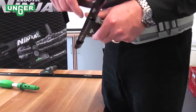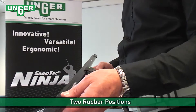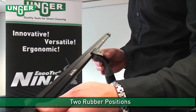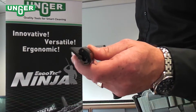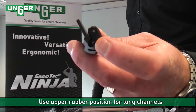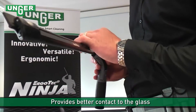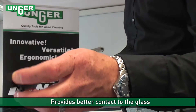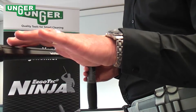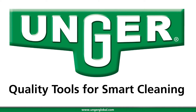The Ninja channels also feature two positions. With larger channels such as the 105cm, you would use the rubber in position number 2. This pushes the rubber up higher and gives more contact with the glass to ensure that you have an even wiping effect.